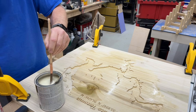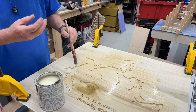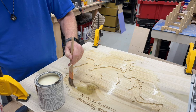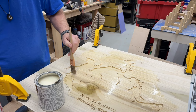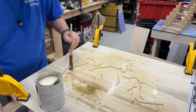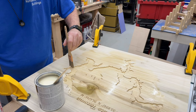Anyway, out of this whole process I'm going to brush this lake full and make sure I get the edges really well inside the lake, because if you don't, the liquid epoxy will actually wick up in there and bring the color with it. You'll have all these wood fibers full of blue and you can't hardly sand it out — so it's easier to just prevent it.